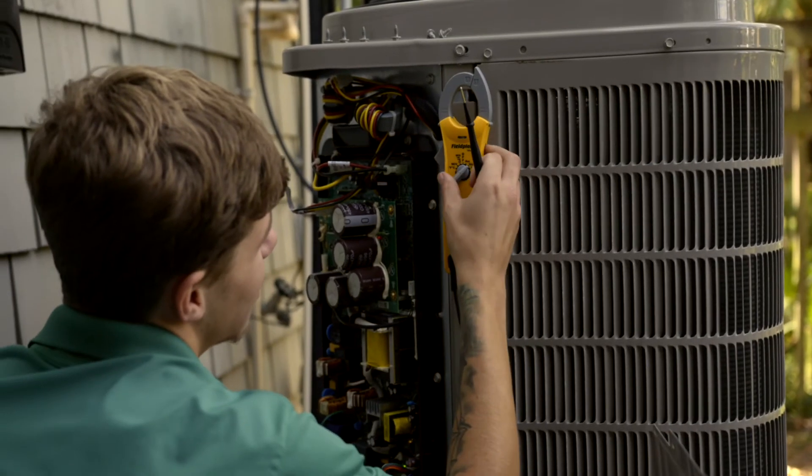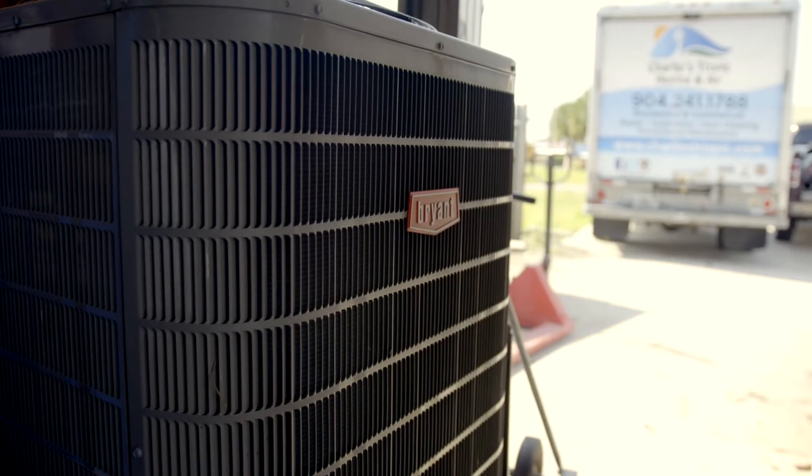When you have to look into replacing parts that are leaking in a unit, you also have to look at how much refrigerant a unit will need. You have to find the leak and replace the part. You don't want to just fill it up with refrigerant and then have it leak into the environment — we are held to some strict standards with the EPA.